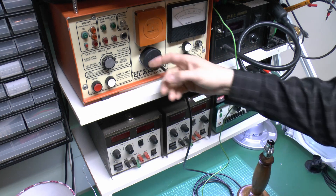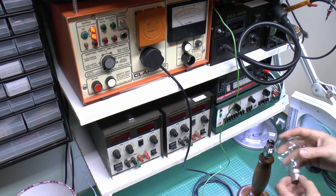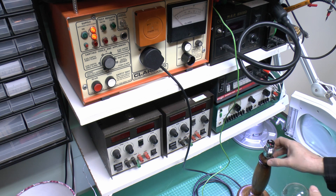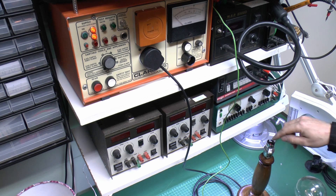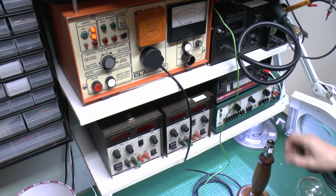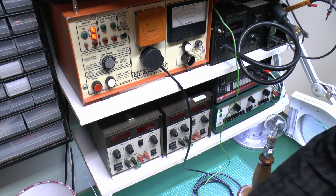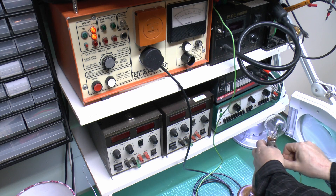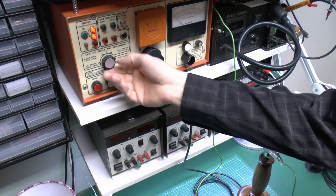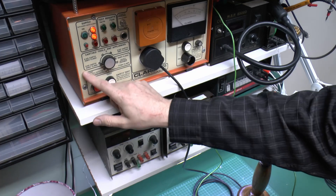So just to get this set up - we've got the item here and we've plugged it into the front of the machine. We're going to set the machine to the standby position so we don't get any unwanted voltages, and turn on with the button on the front. We're installing a normal filament lamp into the device, because the switch can't be moved to the on position unless something is actually in the top. Although in theory there could be a fault between one of the pins and a metal outer part, that wouldn't show up unless it was in the on position. So we put the lamp in and move to the on position, then attach the test clip for continuity to a metal part of the holder - this much bigger clip fits on much easier. We select earth continuity at maximum 0.1 ohms and 1250 volts.